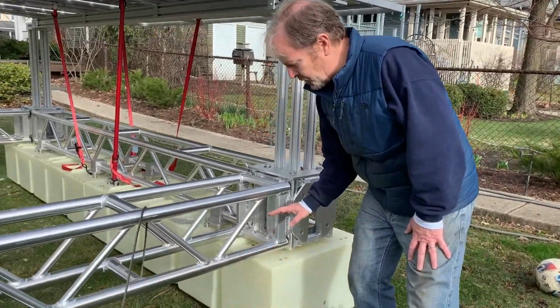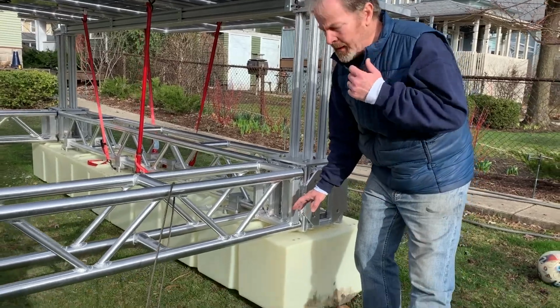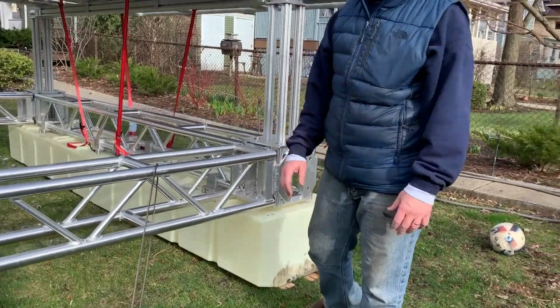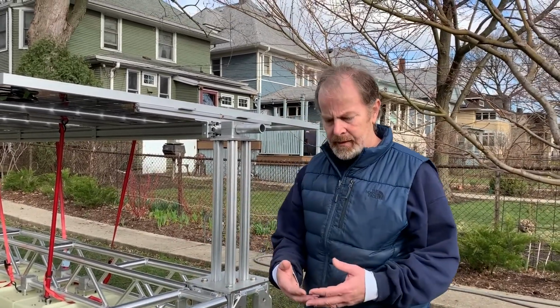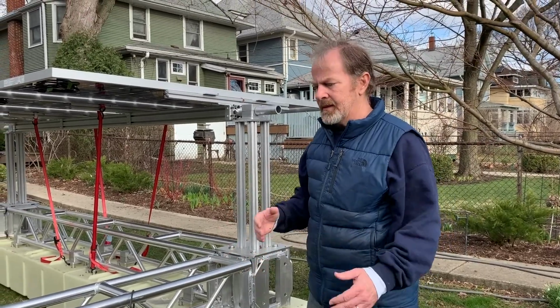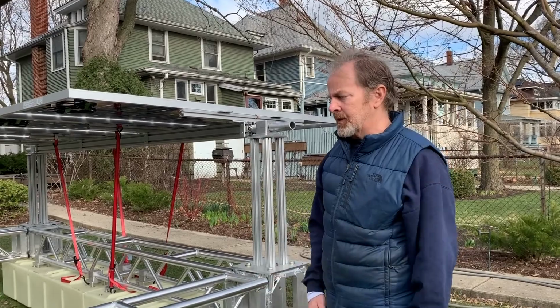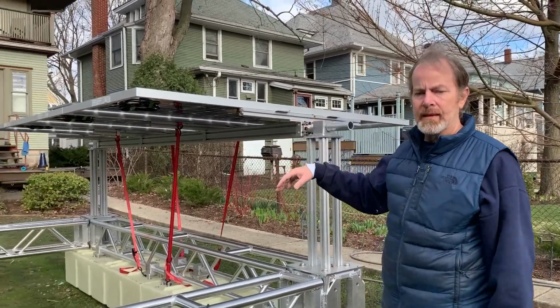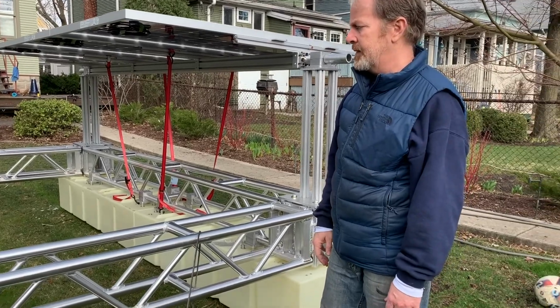The tanks will rise to about 6 inches higher to get the ballast weight we need to keep this stable. We might have to put, if you will, cleats or almost like a keel on the bottom of this to keep it from sliding. Overturning, we're good. Uplift, we're good. This, of course, presumes that these would go to the stowed position in very high winds.